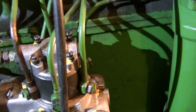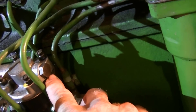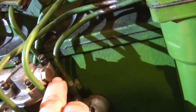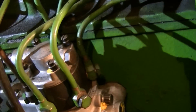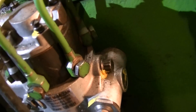If you're having problems and want to do pressure tests, this little bung comes out right there. An eighth-inch pipe is close enough to the threads of this bung — if you turn it in by hand you won't do any harm. By working the manual pump you should be able to get four or five pounds pressure on a zero-to-15 gauge. At cranking you should get maybe 25–30 PSI at this bung, because the vane pump on the inside will be making pressure to feed the plunger system inside the pump.